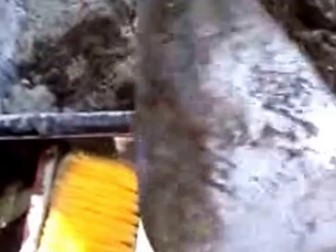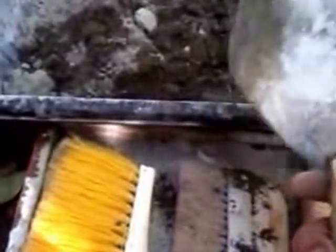So the first most important tool is going to be the trowel. This has been with me for maybe 15 years now, and it's nice and round. I don't have any points on it anymore, and it's just an old comfortable tool that I'm very familiar with. So we have our trowel, and that's going to be our basic mortar spreading tool. Then we'll have a pointing trowel, a smaller trowel. This trowel helps you get in the tight corners, do some tight work, clean up, and it's a little bit more pointed, so you get a little bit better point on that.